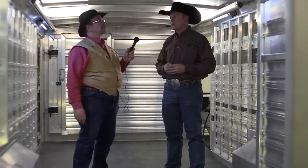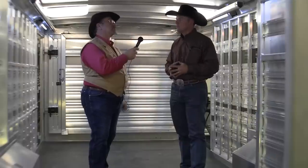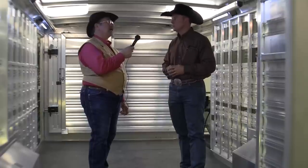What are these giant dome lights in here? We're at the National Western Stock Show and these are some lights we just added to help show this product. The LED lights on the side are a great option — we're doing a lot of those in our trailers now. They draw a tenth of the power, they run cool, and they have a neat look to them. Now, are the bows closer together on a stock trailer than on a horse trailer? Yes, a little bit closer — about 24 to 30 inches on a stock trailer — to help reinforce the trailer. We know they're going to get loaded to capacity then be empty, so a stock trailer gets a lot of abuse. Horses ride fairly still, but cattle dance all the time in the trailer — they never stop moving.